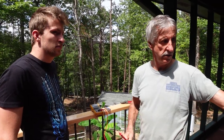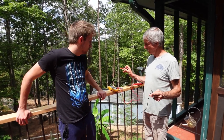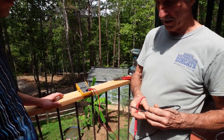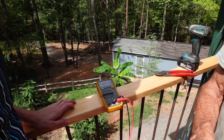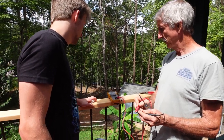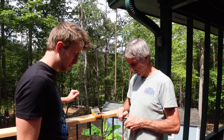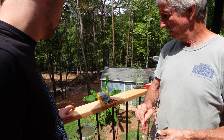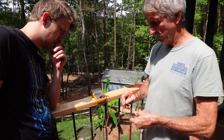Let's say there's a wire here and a wire over there and we want to see if it's the same wire. If we put a probe on one end and a probe on the other end, there should be no resistance. If we touch the probes together, watch — there's 0.1 ohms, which is very little. Now if we put this on this metal piece, we get 1.2 ohms resistance because of the rust on the screwdriver.